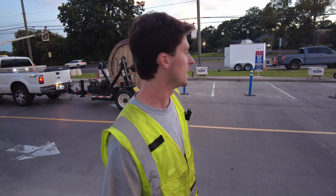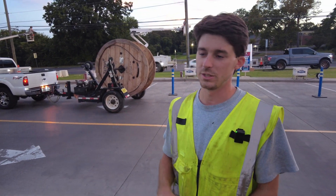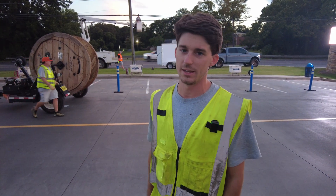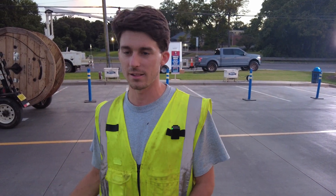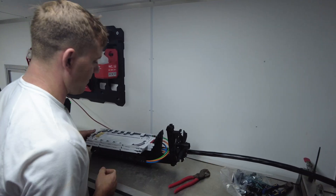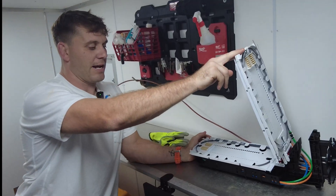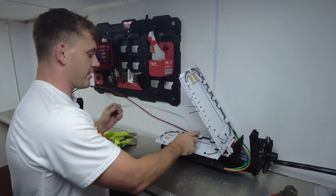Our fiber splicer Dalton is set up on this cable. We've put up a 288 cable to replace the three existing cables, which consists of a 96-count and two 24-counts. That's just to have future flexibility if we ever needed it. He's going to prep this 288 cable. We sent out a notice to all of our customers on this cable that we would cut it tonight at nine. At nine o'clock we'll cut the existing cable, and all of our customers will go down until we splice this in and then splice the other end. He prepped the 288 ribbon — all he needs is the first three tubes because it's six ribbons per tube. He threw them in the splicer and is splicing the 96-count and 24-counts. Once they get in there, he'll prep it and splice it up to the 288 ribbon.